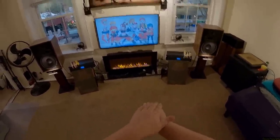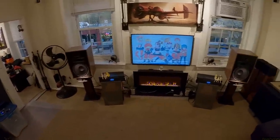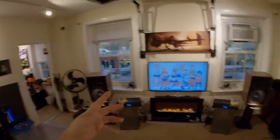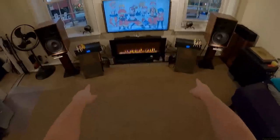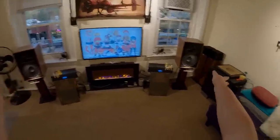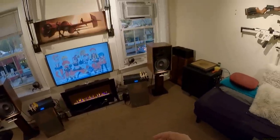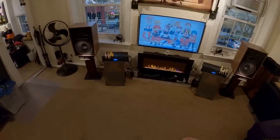In my case I actually have a different DAC for the treble versus the 12-inch. I have a mini DSP Nano Digi so I have digital control of eight separate channels. The subwoofers are on one, the 12-inches are on another, and the horns are on another — I can just turn them off, up, down, or change the phase. What I've determined is these need about four solid decibels less on the horns when you're getting into the 'that's kind of loud' territory.